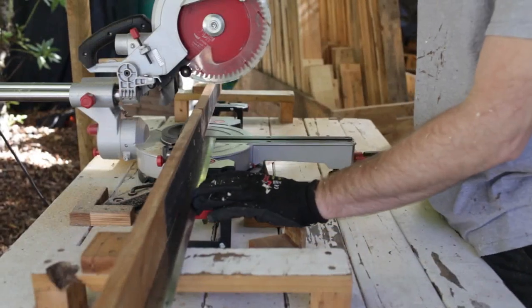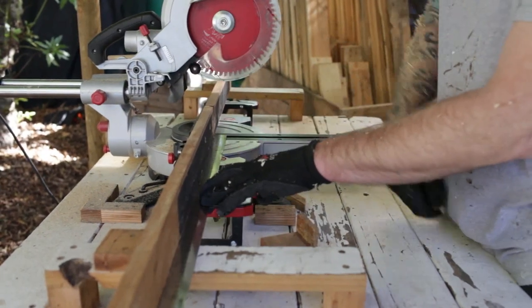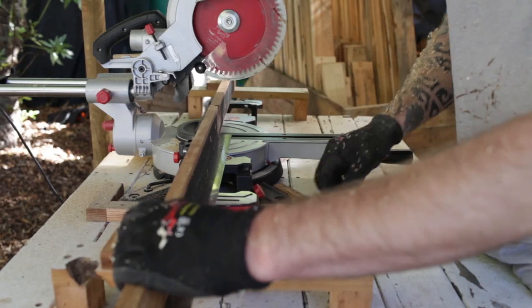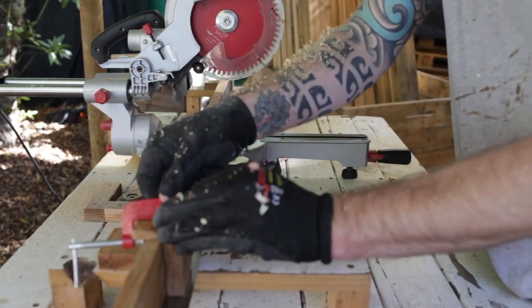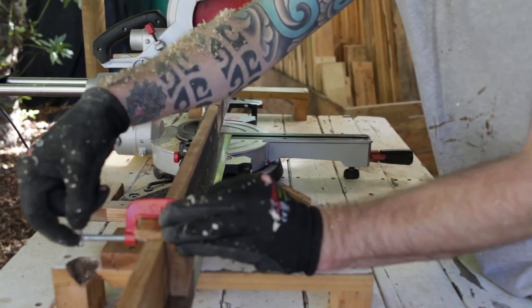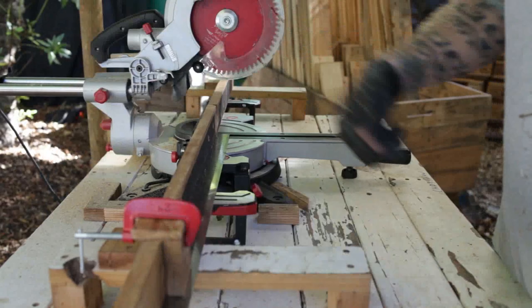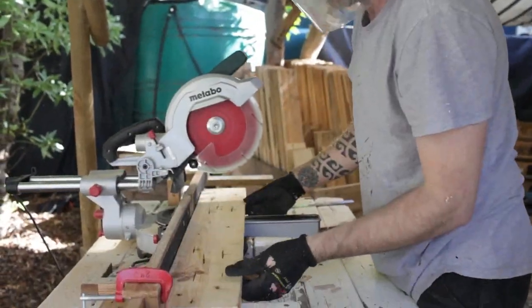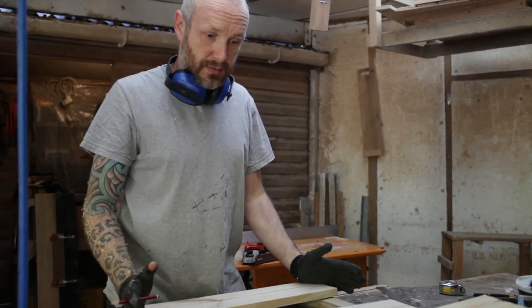So I'm basically setting up my saw — this is my DIY fence. I reference my ruler against the blade and I'm going to set it to 54 centimetres, because I'm going to do loads of repeat cuts and I want them to be the same length without having to measure every time. So here's my DIY stop — clamping a piece of scrap wood. Now we've got a nice 54 centimetre length and we've cut the boards down to the right length.